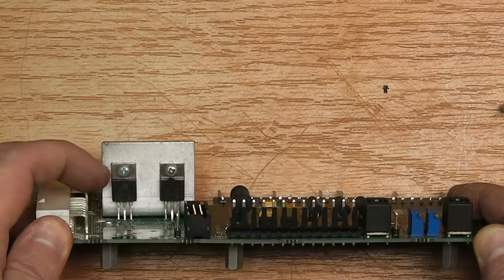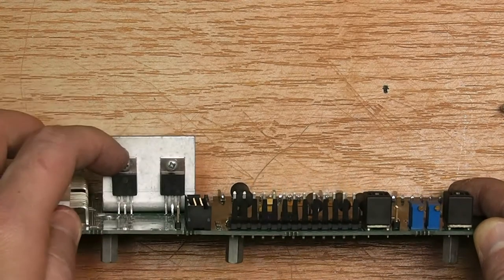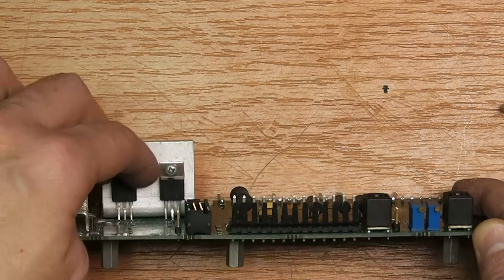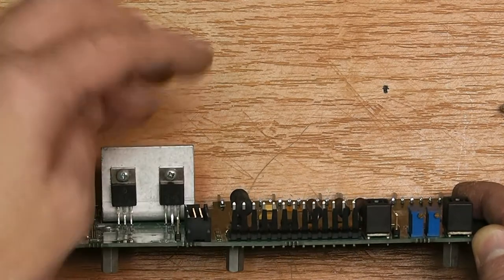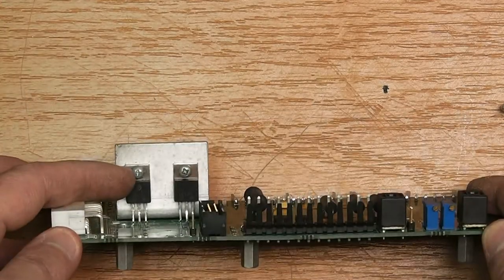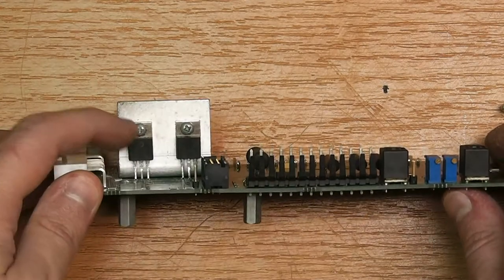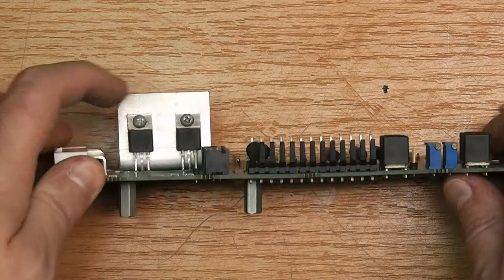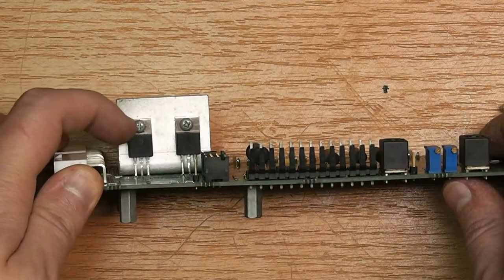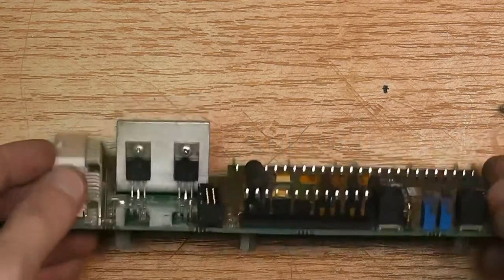And the interesting thing is the two diodes in each casing are parallel, and the two parallel diodes of each casing are also paralleled. So this means they needed a really, really strong diode, and they obviously mounted it on one heatsink, because if those have thermal drift, it can create really nasty problems if you have diodes in parallel.